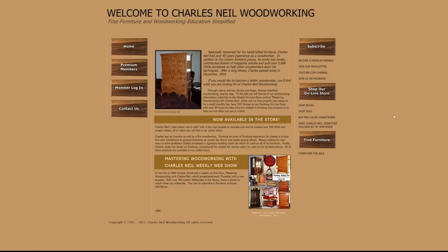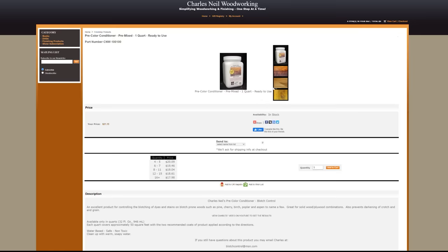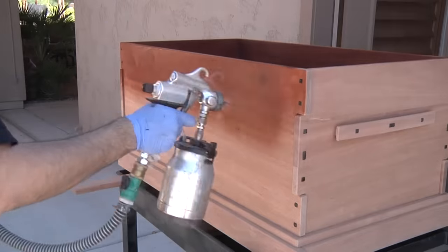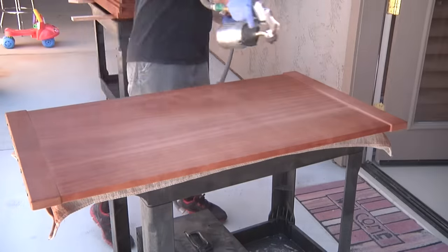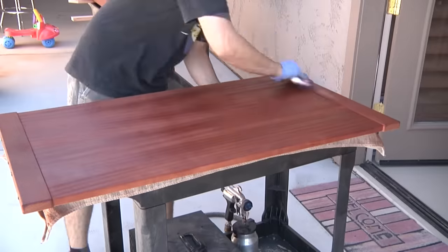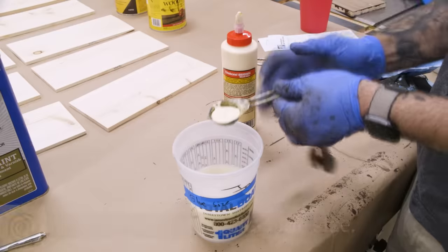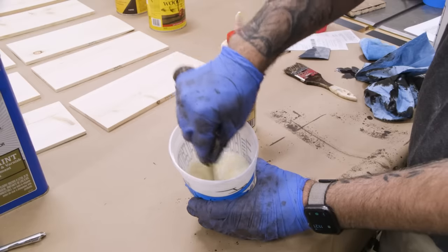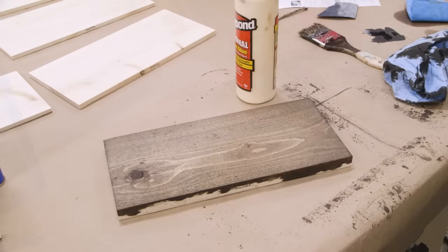The best commercial conditioner I've tried is made by the late and great Charles Neal — he passed away a couple of years ago. I hear mixed things about whether they're still taking orders on their website, but it's still up, so if you want to try ordering some, go for it. A somewhat more advanced way to prevent blotch is to spray the finish with some color in it, sort of like a toner. Each coat builds up color and stays on the surface and doesn't actually absorb deep into the wood fibers — so if the color can't absorb, it can't blotch. Another classic trick is to use glue. Take regular wood glue and dilute it heavily with water and you create something called glue size. It works a lot like diluted finish in theory, but in practice the results are actually a lot better. Glue size not only prevents blotch but also allows the color to penetrate so we get a pretty true representation of the stain.